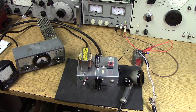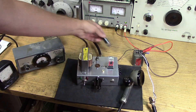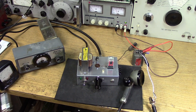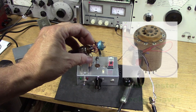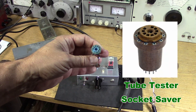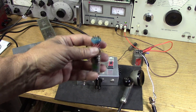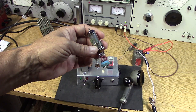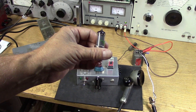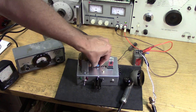OK, so here's where we go from regular engineering into extreme schlock engineering. Let's remove the 6CL6 - it's a little warm because it was just on. I have built an adapter - look at that, it has a 9-pin base made from an old tube saver. Remember the tube savers? You'd have a 9-pin on one side and a 9-pin socket on the other, or a 7-pin on one side and a 7-pin on the other, or an octal. I've removed the bottom of that, soldered some wires on there, and put another socket up top with the 6BH6. It's a Gonset 6BH6, and I'm going to plug that in just like it was a tube made for that socket.